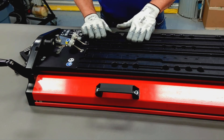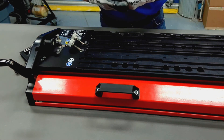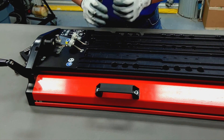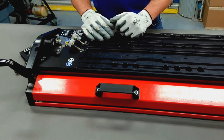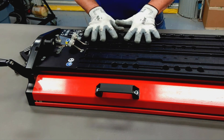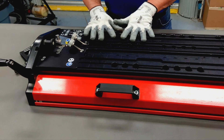If you don't put it in adjustment, you could have an uneven bead in your final splice. Or if the blade is loose enough, you're not going to get a straight cut along the width of the belt. Now that everything is in alignment, I'm going to tighten things up and you'll be able to operate your Amigo once again.